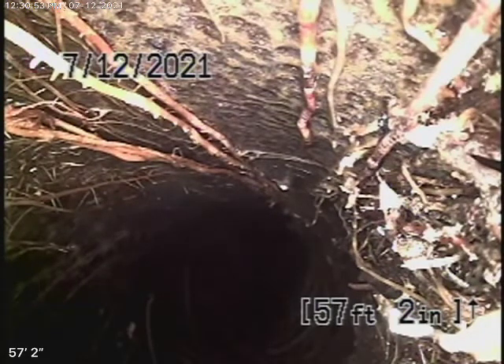We're just coming up to the property line. We can't push the camera any further, but we did locate another section of exposed pipe that we're going to disconnect and run the camera from next. Coming back nice and slow — we're in a clay pipe. You can see there are some minor roots in this clay pipe, and then we go up vertically into ABS plastic.